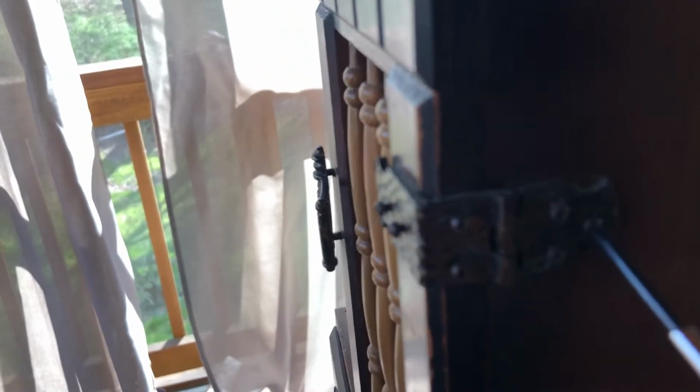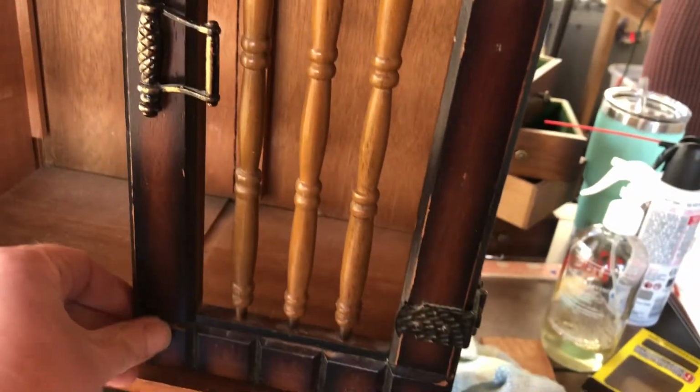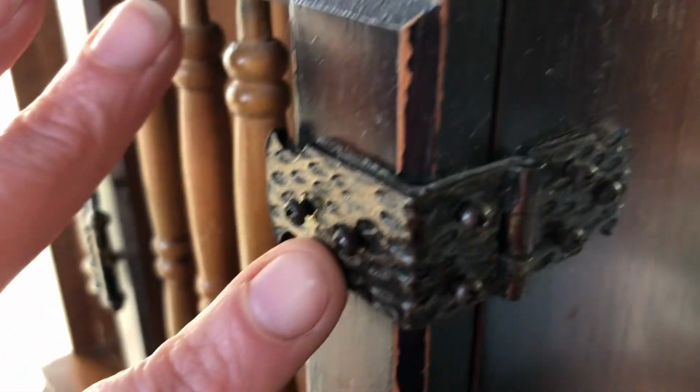Then I'll go back, and there's a lower set of hinges, so I'm gonna loosen that one a little bit. And then I will start taking them off. It's really great if you can still keep this set, so this is holding it up. It's actually held up, see, by the jewelry box itself. Otherwise, just get somebody to stand here and hold this so it's not wiggling around and you're not ripping the holes that the screws go in bigger.